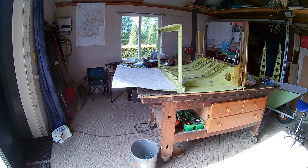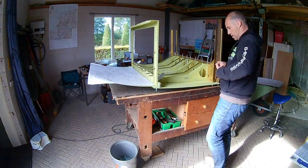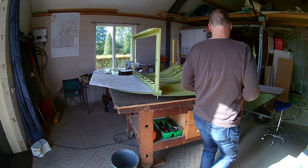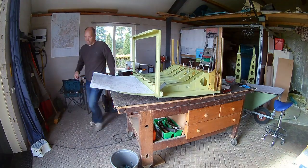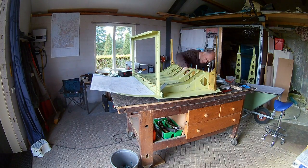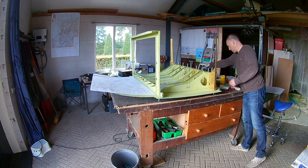I have to find some wood to lift the construction so it won't sit on the clekos. Now attaching the ribs to the bulkhead, and I need to detach the first part — the front part of the main bulkhead — so I can access the holes that I need to drill in order to fasten the ribs to the bulkhead.